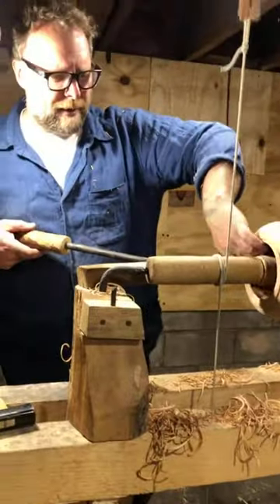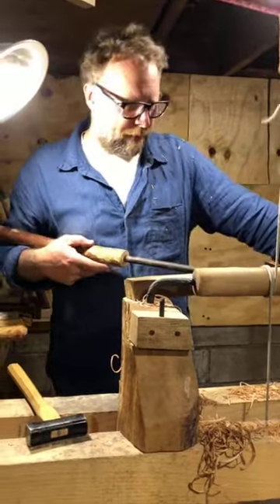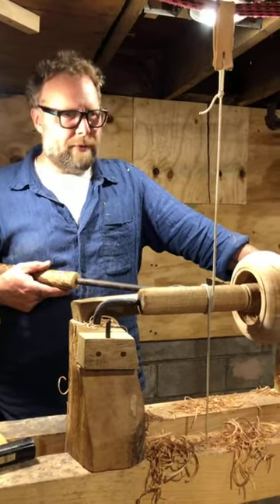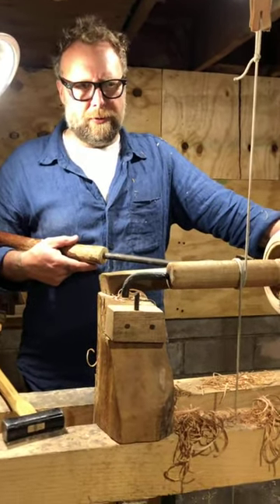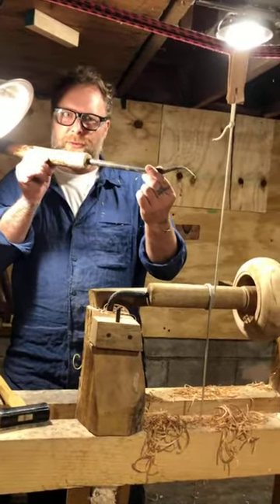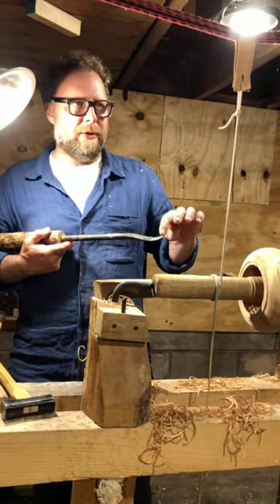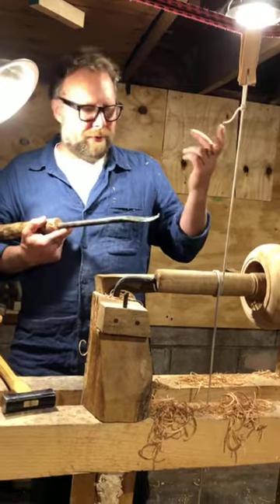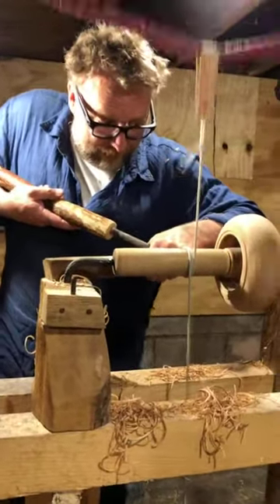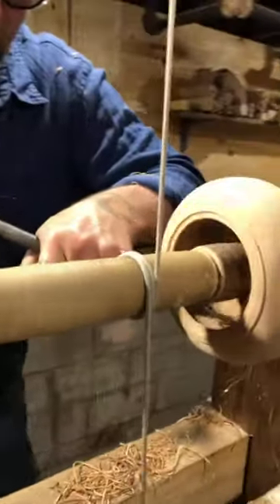The more I turn and think about hooks — for any pole lathe turners out there — I'm honestly thinking that tapered hooks serve very little purpose. An untapered hook just works better all around, and any time you need a little skew you just have to twist your wrist anyway. Some of the sharpening from the antiques we see — they sharpened the tips down. But I have been making less and less hooks with any taper, and I haven't been able to notice any difference.